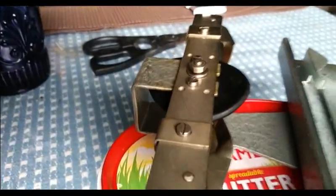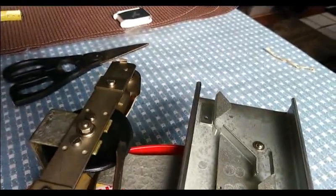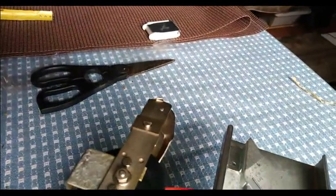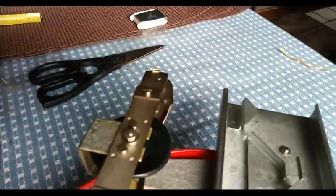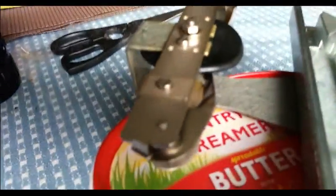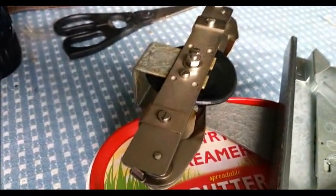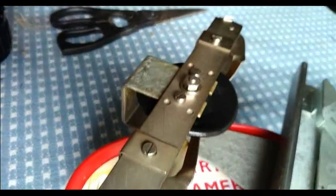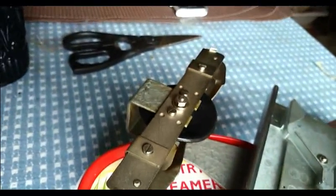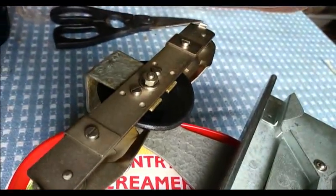I had to change the angle that this piece makes because it was holding it too close to the gate pegs when the rubber wheel was in the right place. We're not suggesting it was made wrong — we think that was a wear-and-tear factor. It was stored with the cam box on the bed long enough to make a mark where this wheel sat, and you can see the wheel dips right here. So this wheel stayed pressed up against there and continually put pressure on these little spring arms and on this bracket. Not knowing the life of a piece of equipment, you don't know how it was stored or if it ever got dropped, but we've got this one knitting quite well now.